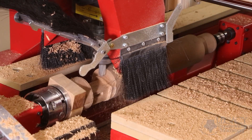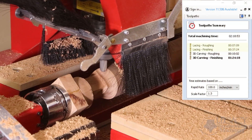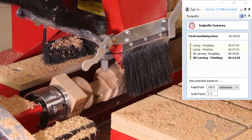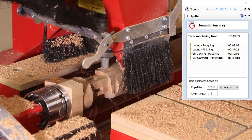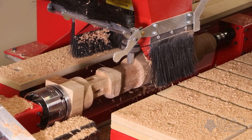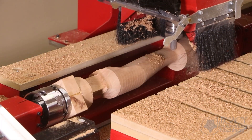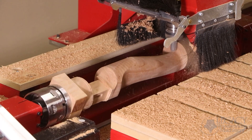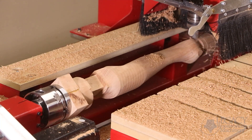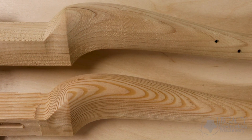Now back to the lacing technique. We've found this technique can be 2–3 times faster, follow symmetrical and asymmetrical shapes, doesn't create a seam or part line, and leaves behind a smoother surface finish. To reduce tool load and part chatter during the finish pass, a roughing pass is used to remove a majority of the material. It's easy to see the difference when a roughing pass is not used.